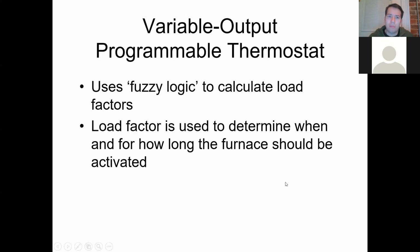All right. Again, fuzzy logic. What it's talking about is the processor. It's algorithms and codes and all sorts of stuff like that to try and anticipate how much heating it's going to need. When it has a memory bank, it can be more solidified in that logic. It can actually remember what happened last time when that kind of a heat load happened, or when that weather came around the same time, how the house reacted, what level of heat it had to produce for it. So that's when it gets really cool with a lot of these new ones.